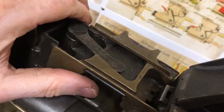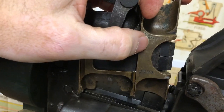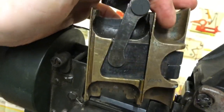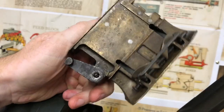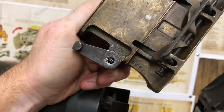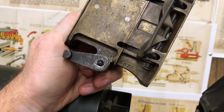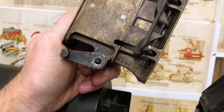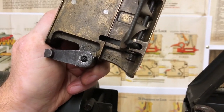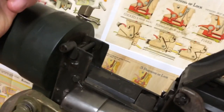Let's open up and have a look at the feed block to see what it tells us. This is an Australian feed block - MA again, that's the made in Australia marking, and we've got 1942 with a couple of broad arrows, and V303 which is Vickers 303. On the bottom we've got the serial number B8674, so that's the gun the serial number was originally from. A word of caution though - that may not be gun 8674 in the Australian series, as sometimes the letter prefix is missed off. You can just see the number, like 2296, because the chances of having gun 2296 and B2296 in the same location are highly unlikely.